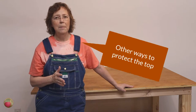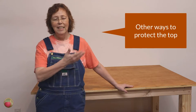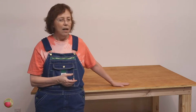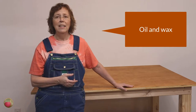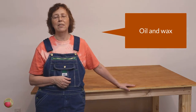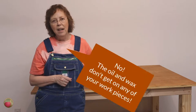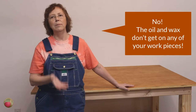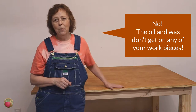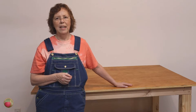If you're doing glue-ups, you really don't want glue sticking to the bench, so you can use craft paper, a tarp, or anything over your bench for that. Another option is what I did here — I put some boiled linseed oil on it and then paste wax over the top. Glue just knocks right off. And no, none of the oil or wax transfers to your work piece — the wood soaks it in.